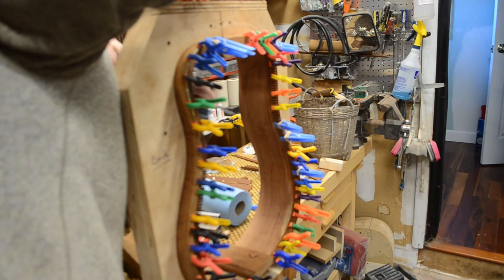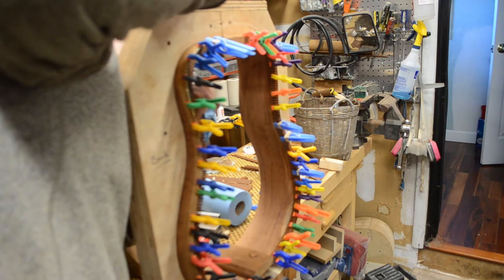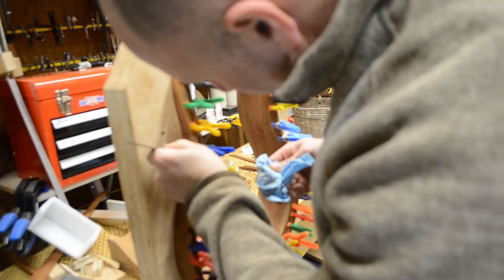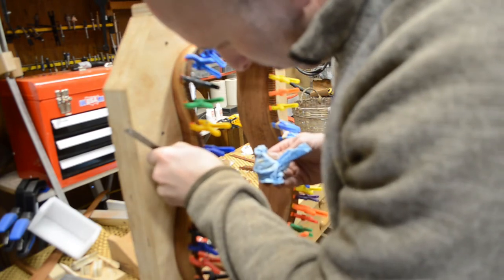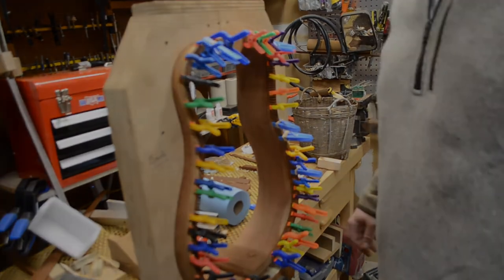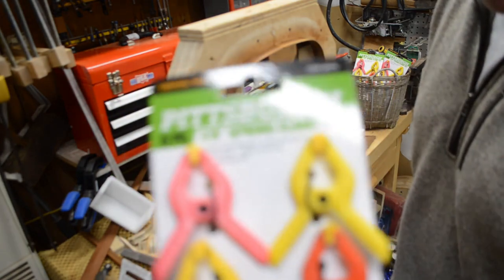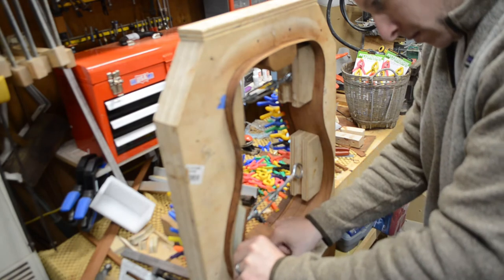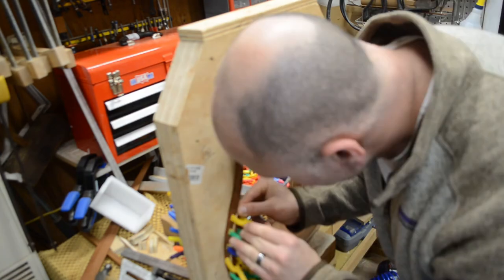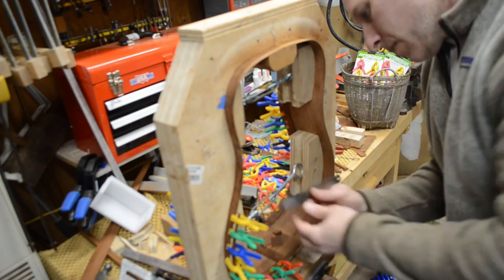Here I am scraping out the glue as well. If I get any glue between the kerf cuts, I try to get that out too. I just think it looks really nice when you have a high-end guitar that has no glue squeeze-out left around the kerf linings. Here it is all done. Now before I could get the back going, I ran out of clamps. I use these Harbor Freight clamps — they're just perfect for these kerf linings. They have little articulating tips so they kind of conform to the angled kerf lining really well, and they're strong with a lot of tension.